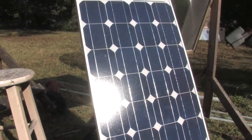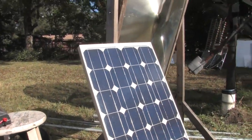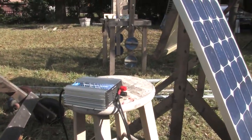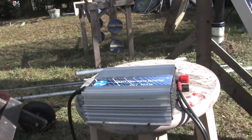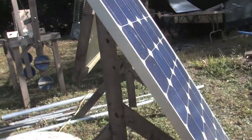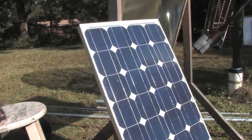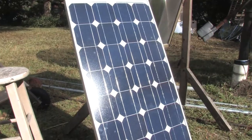These solar panels have actually seen quite a price drop lately. This 80-watt, 12-volt panel produces 21 volts open-circuit, so it will run a pure sine wave inverter like this one that is grid-tied directly. This panel costs about $250 — completely sealed with everything on it. I'm your host Dan Rojas, thank you for watching and enjoy our videos.